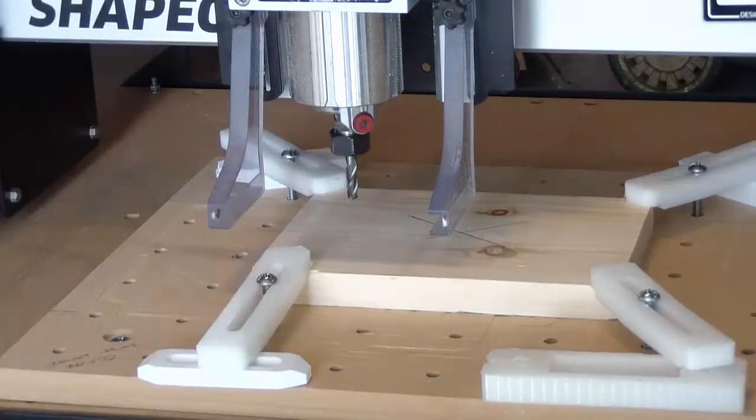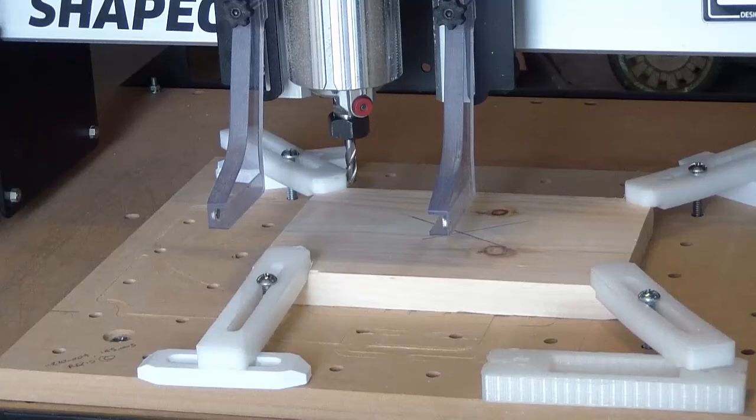One of the things you might have heard at the very beginning is that when it went to the height of the Z, it hit its maximum spot. And so that meant that I would have probably lost some Z steps in this particular operation. That's because I set the Z really high for this air cut. So you want to make sure you listen to your machine at the very beginning. If you hear any kind of colliding in any direction, then you're going to miss steps and you're going to ruin your cut. Now I'm just going to reset my zero and actually cut something. I shouldn't have the problem with colliding up in the Z direction once I set it to the correct height.